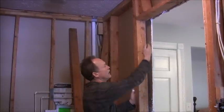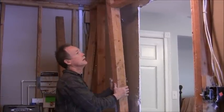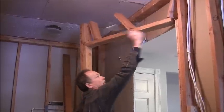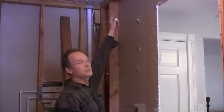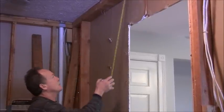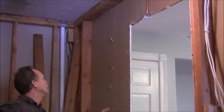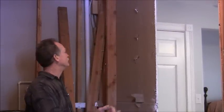Let me tell you a couple of things I did. I went ahead and ran my reciprocating saw down between the drywall and the door jamb itself and cut the nails off — that made it come out a whole lot easier. We've got a couple of holes on the other side. When I was cutting the nails up at the top plate I went through the drywall a little bit, but you can patch them real easy. The worst is down here where I pushed through some, but it's nothing too much to fix. Or, like I say, you can replace all the drywall if it's not a finished room.